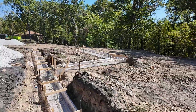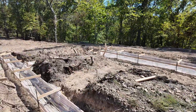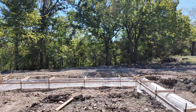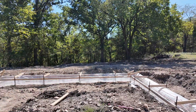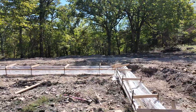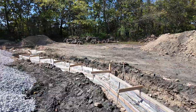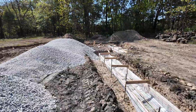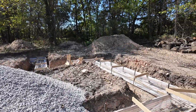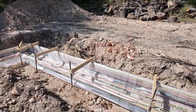If you remember last week's video, the patio grew, which is why we have that weird ditch in the middle. The original drawn patio would have gone where that ditch is, and now it's been shifted. This area is 34 feet wide and we're going to center a 20-by-40-foot ICF pool just a few feet beyond it toward the woods — auto cover, hydronic heat in the floor, just like the house. That pool will have its own permit. There is also a rough-in plumbing inspection for subgrade plumbing before we pour the walls. Because the walls are over 10 feet high, they'll require a letter from an engineer to sign off that I followed Logic's rebar schedule.